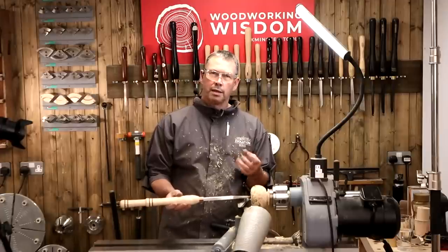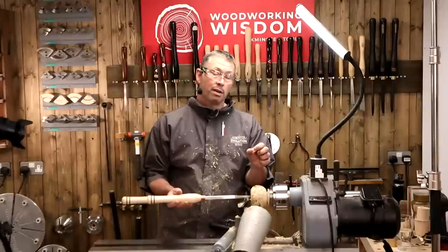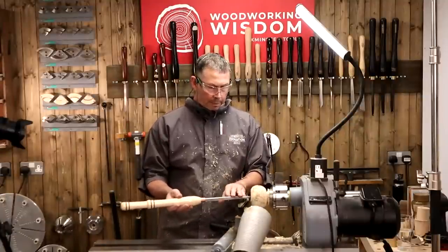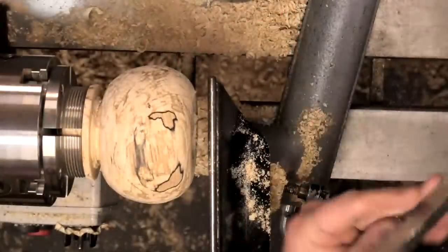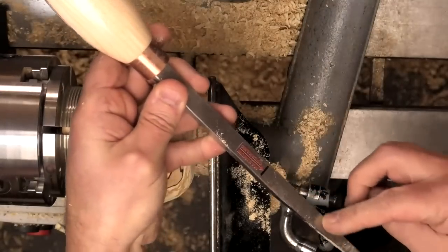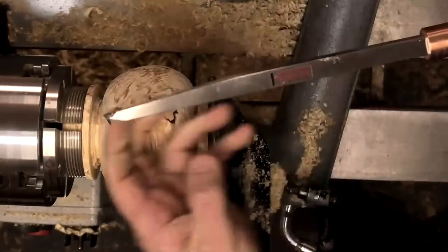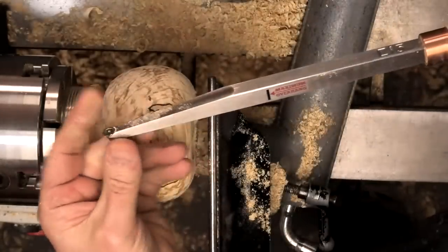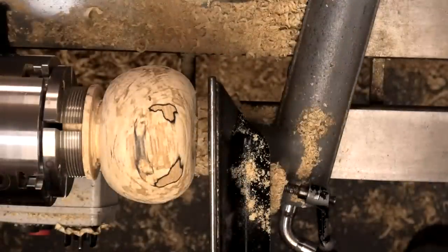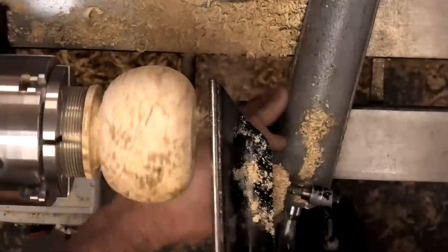When you go to bigger cutters, that's when it gets a little more aggressive because you're physically taking more off and it's a bigger working area. But with the small cutters, they work so well. Like all Easy Woods, you've got the maximum overhang, so just bear that in mind. Work with that rather than go past it, because otherwise the leverage kicks in. It works really, really well. Horizontal or slightly raised. Guys, I think that's enough with that piece for the minute.